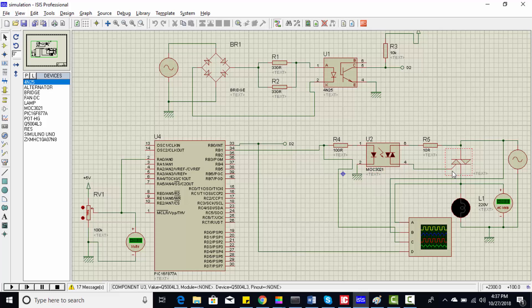The operating range of this thyristor depends on the firing angle. If the firing angle is maximum, voltage will be low at the output across the lamp. If the firing angle is minimum — that is, if we fire right after the zero crossing — we will get full voltage across the lamp. So what we do is first provide a maximum firing angle, then start decreasing it so that the voltage gradually starts increasing.